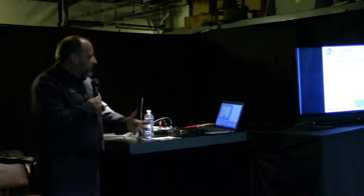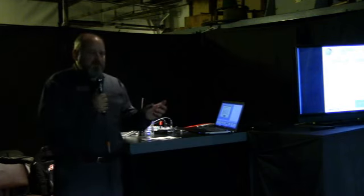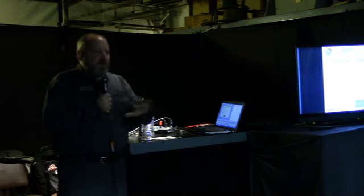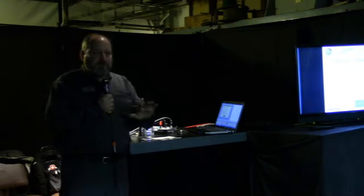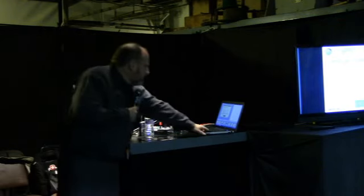You can also connect, we talked about the DV Dongle, from a PC without any radio. There's also the ability to do the low-speed data, which gives you some kind of chat-like functionality. With a program like D-RATS, you get some chat functionality. You can actually send small photos. You can transfer files. Again, all at 1200 baud, so there's no magic there. It takes as long as it takes, but it does work. And of course, if you have high-speed data needs, 128K baud is a pretty substantial speed for over-the-air transmission of data.